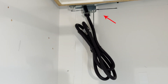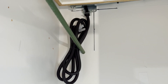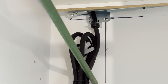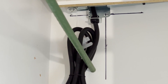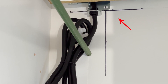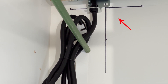Watch as the drawer goes shut — you'll notice that the more the drawer closes, the closer those screw holes line up on the mounting bracket at the back of the cabinet. You can see how that screw hole is lined up perfectly. There's the four and a half inches, and the cross is the bottom of the drawer box. I can go up a whole inch and attach the screw, and that would be precisely where it needs to be. When I pull the drawer open and reach in here, I should be able to get that screw in.